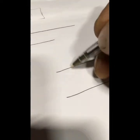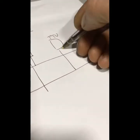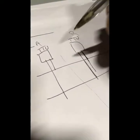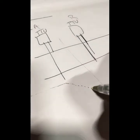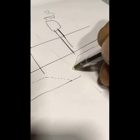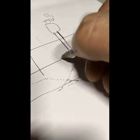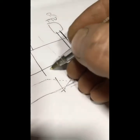On the track itself, what we will mention is you have, as I mentioned, track tuning units, TTUs, the leads of which are kept as straight and close as possible. Say this is an A and this is the B zone. Here you would traditionally have block joints. What you have is a zone between the end of this where the voltage starts to fall off rapidly to zero, the frequency, and on this one the voltage frequency will start to drop off rapidly to zero. Now you will get a slight bit where it overlaps technically, so this goes to here and this goes to here, but we will tune this zone when we set it up. That's our tuned zone between the two.